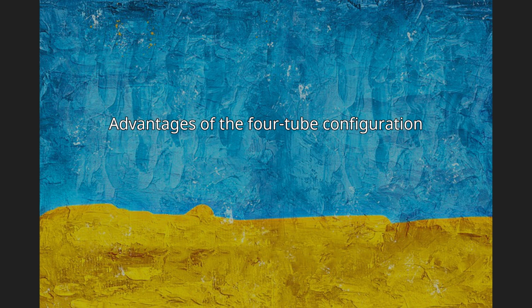In addition to allowing the registration accuracy between the color images to be relaxed, the four-tube camera allows additional misregistration of these three images relative to the luminance image. This is because the presence of a sharp black and white image allows significant displacement of the color content to be tolerated by the viewer, a feature long exploited by the publishers of cheap color comics and magazines.